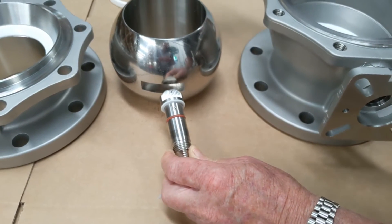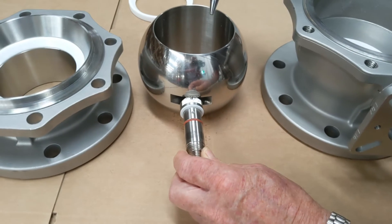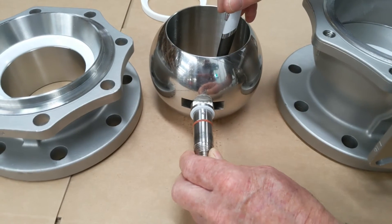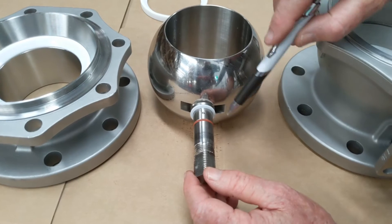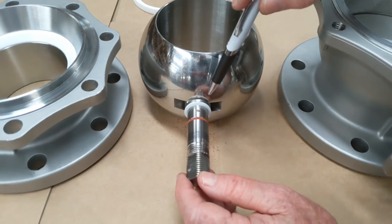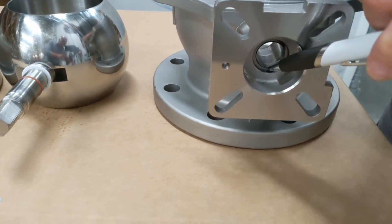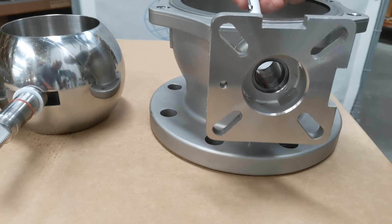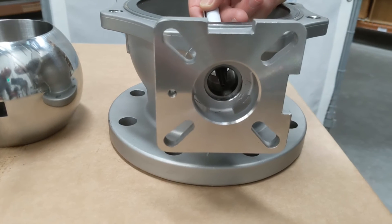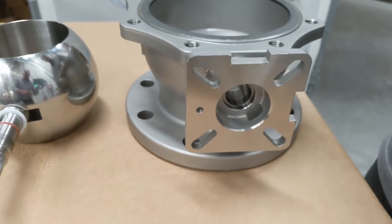I have a set of the graphite crush washers here from a repair kit. The detent is part of the fire-safe API 607 certification — when it goes in, it makes contact for anti-static continuity. Likewise through the stem, as the valve rotates, that detent rotates inside the head, maintaining contact with the graphite crush washers and the ball.